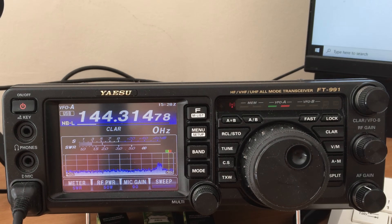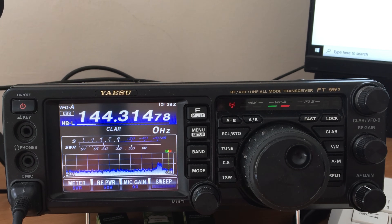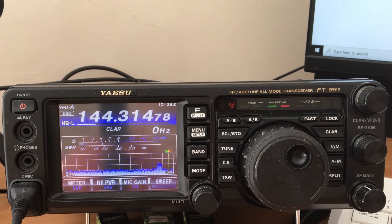The whole reason for going with the halo was it's a nice easy 2 metre option to get horizontally polarized. I'm looking forward to getting it up in the air. On this test I'm only using RG58U with about a 15 metre run, so I've probably got anywhere between 4 and 7 dB of loss. When it goes up I'm going to run it with RG213 — I think I've got some of that. Anyway, thank you so much for the contact — absolutely great, glad it's working.